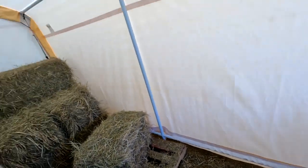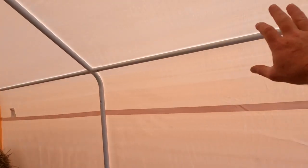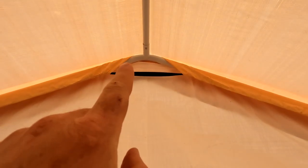You're not dealing with the lower tubes yet. You can screw the lower tubes in on one side but not trap them on the other side. You get it all assembled — one side up, then the other side up — and now your building is up. You still have a couple of joints that can articulate, and that's intentional since your ground may not be level. Once you get the building where you want it, you put all the rest of your screws in to lock its position. Then you put your vinyl end panels on.